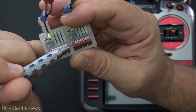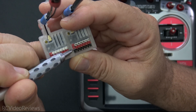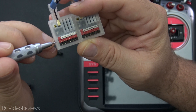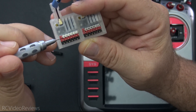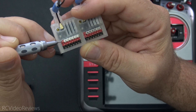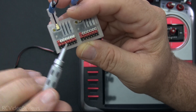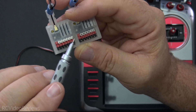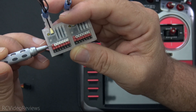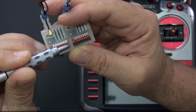On the very left-hand side, notice I've got two red pins in a row. The top pin is a VBAT pin, and the second pin is the standard voltage rail — that's true on both receivers. My intention is to power one receiver and then take a Y lead to connect it to the other, using this first row of pins on the left. If you want to use VBAT, you simply use that pin for power off your battery and connect the one red lead from your battery right onto the VBAT pin. Only do it on one of the two receivers — don't do it on both because you don't get telemetry on the second receiver.